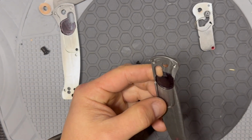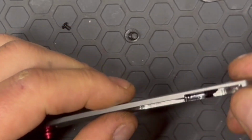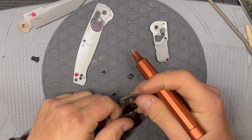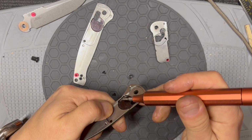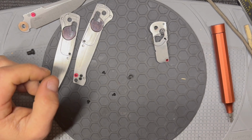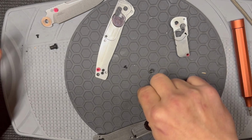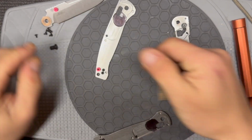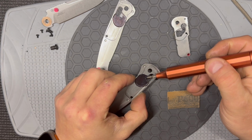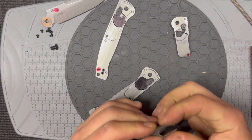So what to do? Oh, I see here a little bit of a snail trailing here. A little bit here on the wall. And just a little bit here. Okay, so let's attempt to correct it. 600 grit, it's pretty good quality. It's a belt from the belt sander that I'm sacrificing. Yeah, you can see in this area there is definitely a raised edge a little bit. So we're gonna try to hit it in all these spots.